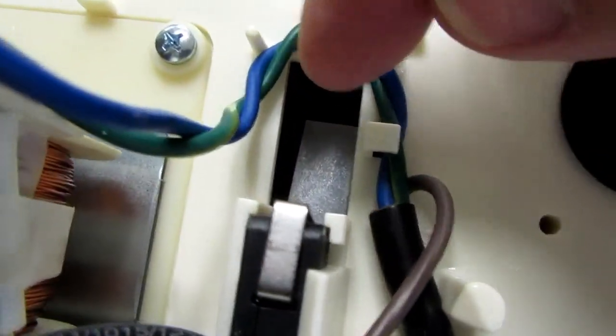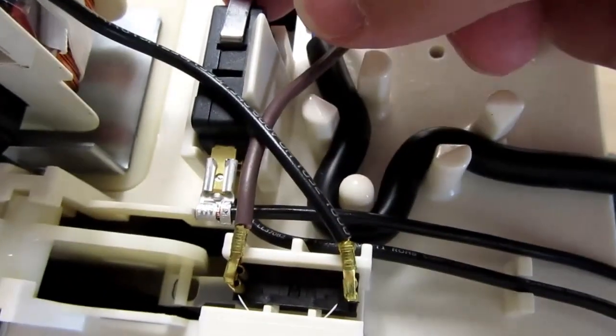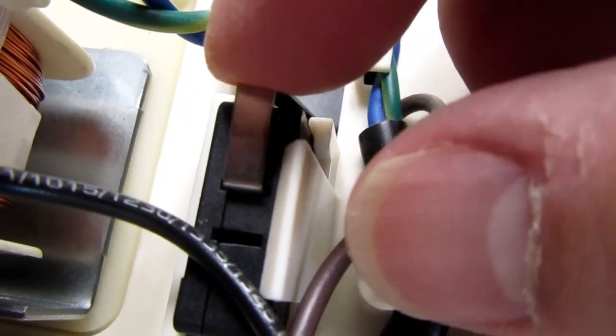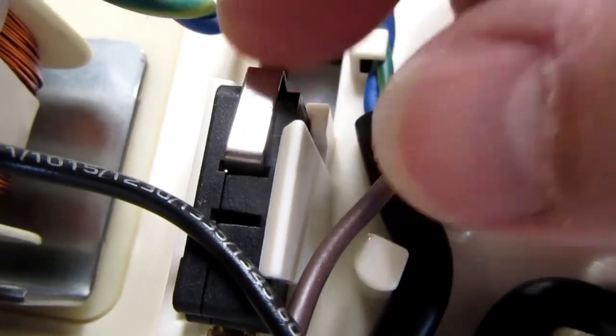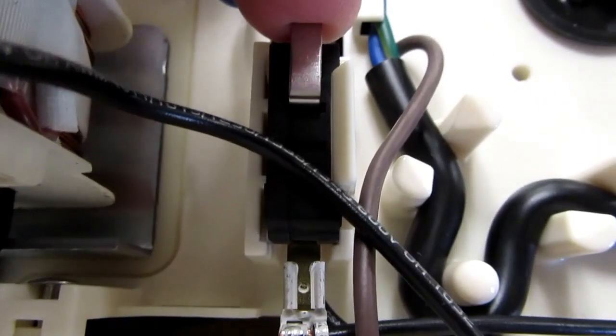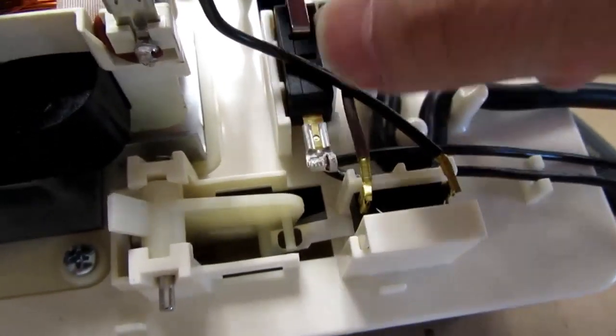Now the secondary switch and the secondary float is this one. You can kind of see the, I don't know, it looks like foam or something, float down there, and it comes to this secondary switch here. And you can probably hear the clicking there. This doesn't seem to have any hysteresis on it, and it doesn't need it, since all it's doing is turning on or activating the switch at the high level. So obviously if you get the model that doesn't have the S in the part number, then this float and this secondary switch aren't even in here.